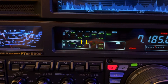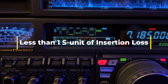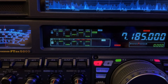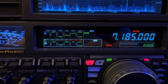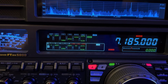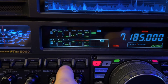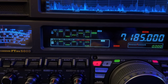The reason I installed this is so I can battle QRM in the front end of the receiver. If somebody moves in close while I'm trying to listen, I can deal with it first in the front end and let the DSP put the icing on it. So I replaced the 600 Hz roofing filter from Yaesu with an 1800 Hz crystal roofing filter from International Radio and put it into where the 600 was. I still have the 300 for CW, but this one is an alternate for sideband to help squash QRM when it moves in close.